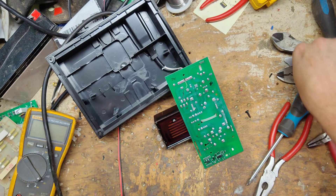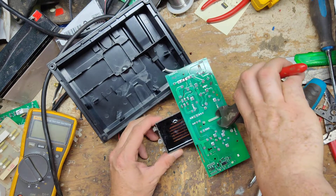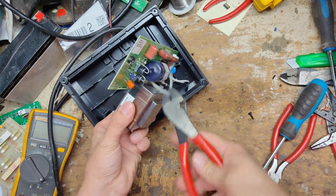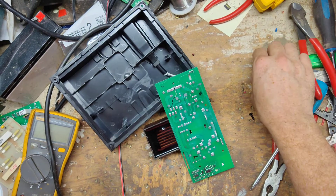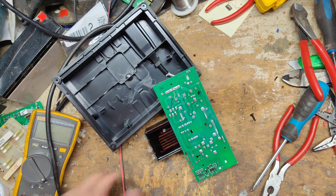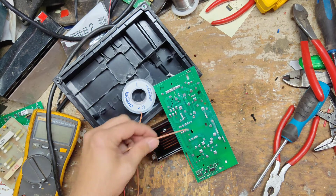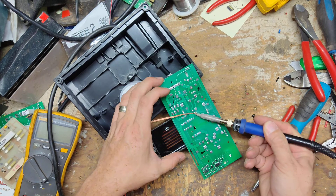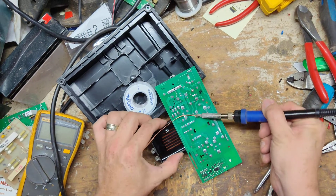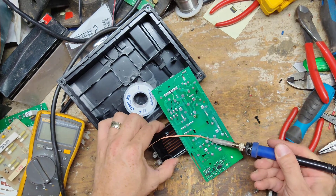You're just asking for trouble. I've done enough of these type of repairs that you're just asking for trouble trying to bandaid it and add some solder to it. That will work for a little bit, then it'll start arcing in about a week or two, break down in about three months, and you're right back to where you started. So we're going to desolder both contacts for that capacitor and put a new capacitor in place. It may not be the exact same one, but it should be the same rating. Maybe the size is a little bit bigger.